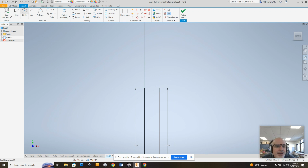All right. Now at this top section, we need to make the little lip on the screw there. If you look at the diameter of the little lip there, it's 0.422. So we're going to make a line coming over here to our right, 0.211. That's 0.422 divided by 2. Again, we want the diameter for the part here, not the radius. They're giving us the diameter, so just divide it by 2.